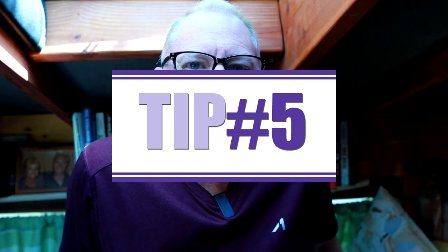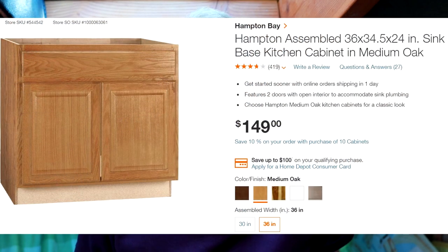Cabinetry: a lot of people will go to a box store like Lowe's, Home Depot, or Ikea to buy store-bought cabinetry, and that can really add up. In the vast majority of cases, some half-inch or three-eighths plywood for vertical supports with a face frame screwed right to a plywood wall — maybe using a Kreg jig — will be sufficient. When I built this tiny house, I had never made cabinets before, but I watched a couple of YouTube videos, did them super basic, and put some nice drawer fronts and cabinet doors on them. The carcasses — the cabinet boxes themselves — almost anybody with some hand tools and woodworking knowledge can do that. So don't buy cabinets wherever you can avoid it. That'll save you a lot of money.